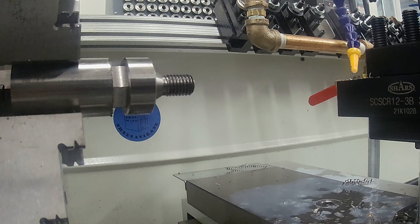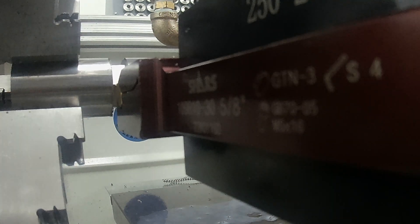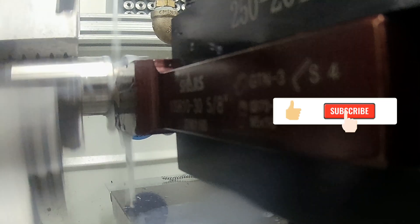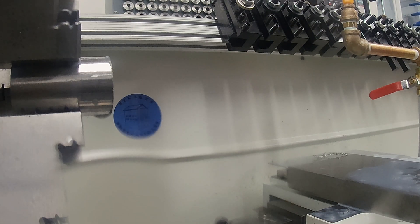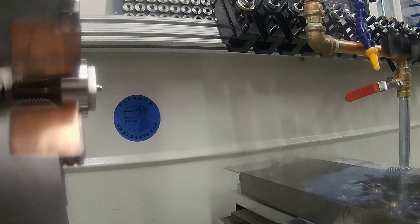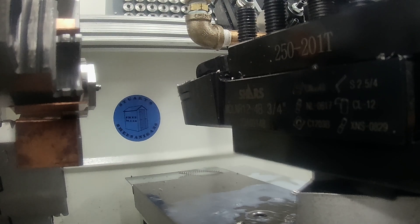Back at the lathe — trying a new angle here to get up close and personal, seems to be working quite well although we'll probably get coolant all over ourselves. Here we are just parting off this special bolt. Half the speed I usually turn is my rule of thumb, with coolant and/or lubricant — makes it go very well. I've got pieces of soft copper in the jaws here just to protect it, and I've turned it round. It's very wobbly so just using a push bar to straighten it out and turn the nub off.